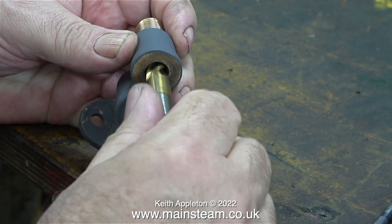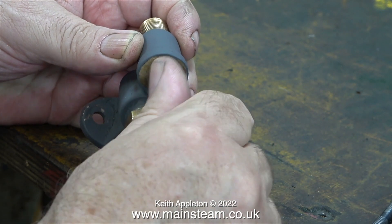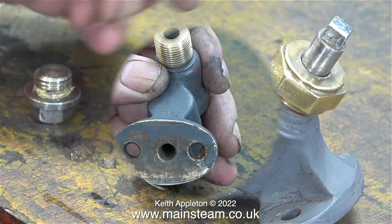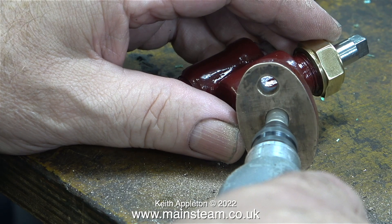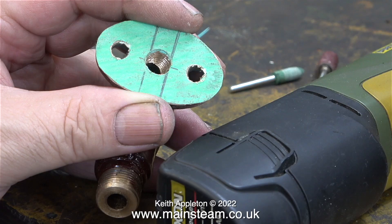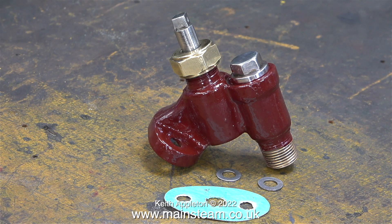What I'm doing here is being a human milling machine. By carefully rotating an end mill — not a slot drill, an end mill with four cutters — I cleaned up the seat. There's quite a lot more about what I did to this check valve in the series 'A Large Model Showman's Engine'; these are excerpts from part 54. One reason I was initially confident this was the cause of the problem was that the hole in the check valve was not in the centre. With the help of a diamond grinder in my Proxxon motor tool, now it is in the centre.